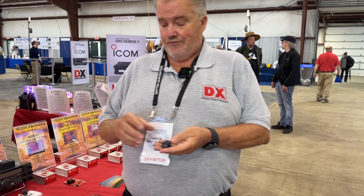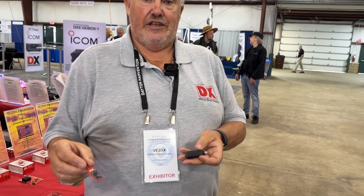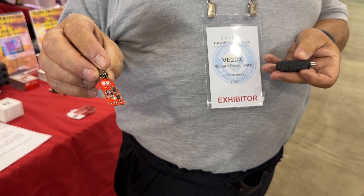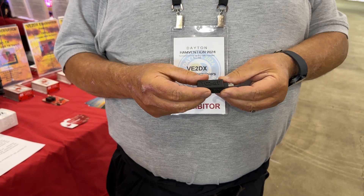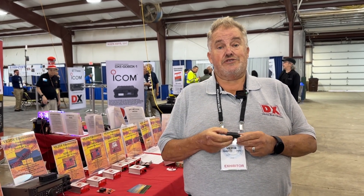Our new YK-2-BT is an evolution of the older YK-1-BT, featuring V2DX design boards and our True CAT technology — auto-leveling and proper RF filtering at every level — in a 3D enclosure designed by us. The YK-2-BT supports the FT-8X7 product line: the 817, 818, 857, and 897. It's also compatible with the FT-100 and, thanks to Yaesu, now runs properly on the FT-710.